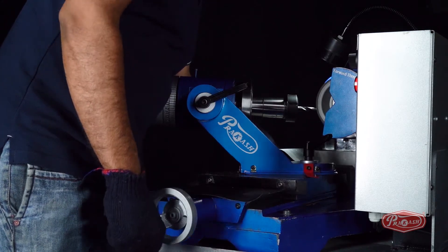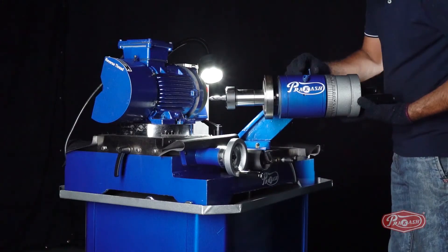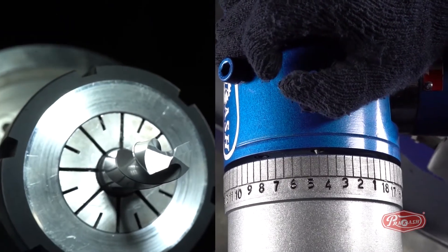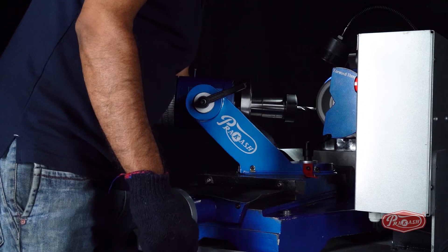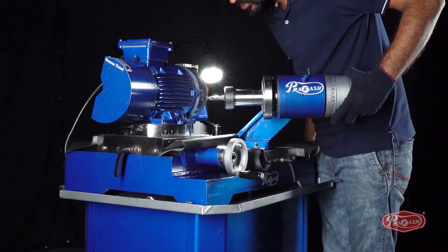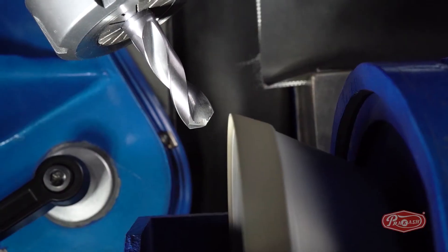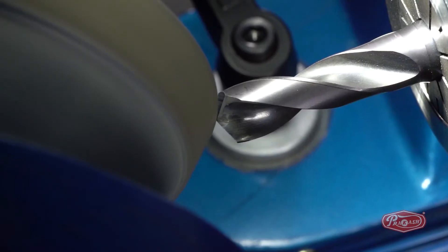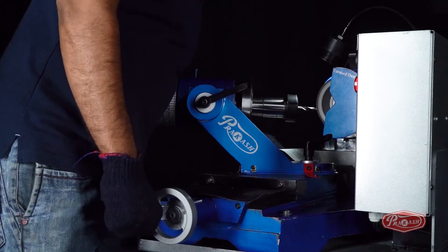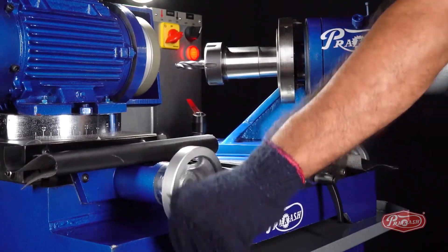Now, using the X-axis, we will move the drill bit away from the diamond wheel and set the spindle dial wheel pin from number 4.5 to the opposite number 4.5. Move the X-axis towards the diamond wheel to the number noted before, which is 40 in the video, and sharpen the second side of the back relief. Then use the X-axis and Y-axis to move the drill bit away from the diamond wheel.